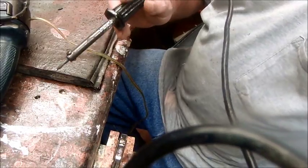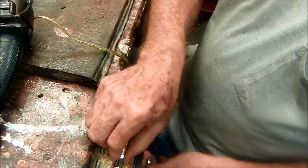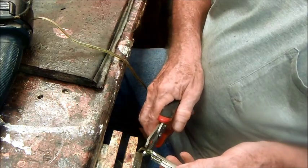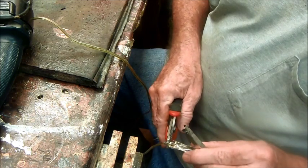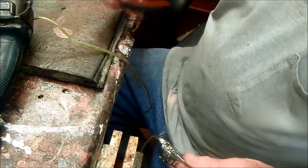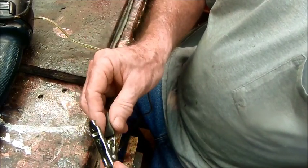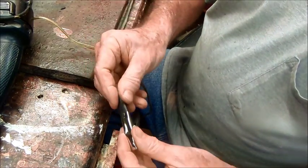Okay, that's soldered. Put the soldering iron over here. You need one of these little things — kind of like a pair of pliers — to crimp it shut. Make sure you've got this little sleeve pre-staged on your wire before you solder, otherwise it won't fit on there afterward.